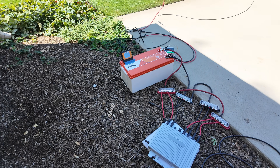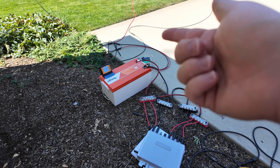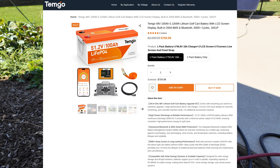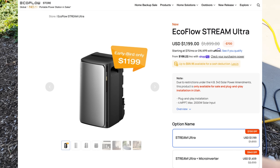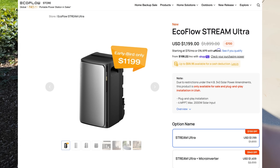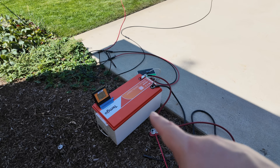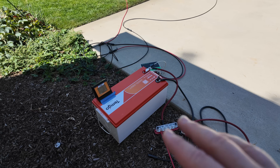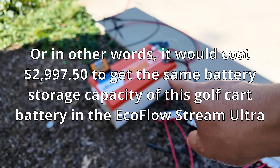The other nice thing with these batteries is you can use them right now to offset the cost of electricity, and it would be very easy down the road to add a simple off-grid inverter so you could still use the batteries and all your solar when the grid is down to power critical loads. Cost-wise, it's a no-brainer. At the time of making this video, these Temgo golf cart batteries are selling between $750 and $800 — no tax, free shipping. EcoFlow makes the EcoFlow Stream Ultra, which is basically the Stream microinverter in a package with a battery. That battery is 1.92 kilowatt hours — let's round it to two. This battery is slightly over five kilowatt hours — let's round it to five. So that's two and a half times the battery capacity in this single golf cart battery compared to what you get with the Stream Ultra. The Stream Ultra costs $1,200, so you're getting two and a half times the battery capacity at almost half the price with these golf cart batteries.